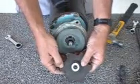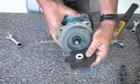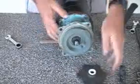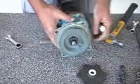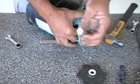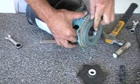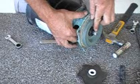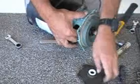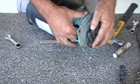Okay, now our two pieces of ceramic, we just want to be careful that we don't nick or damage any of this white ceramic here when we put it on the shaft extension. Oh, and one other thing on the shaft extension, we like to use a thread sealant. I've already put it on here, but it's this same Plasto joint stick. This is a water connection thread here. If water seeps through this thread, it's going to leak out and down the shaft. It won't leak out the seal, but it's another way that water can leak out. So we do want to make sure that these threads that thread into the impeller are going to be a watertight thread.